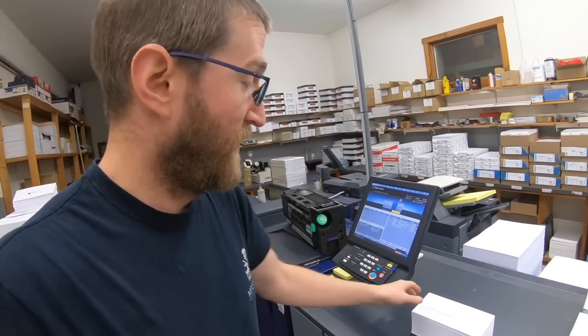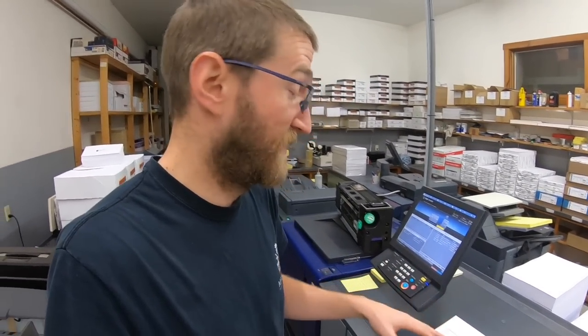Got all the number nines done and started the number tens. I have about either four or five different designs for the number tens, so that actually makes it a little more economical to run on a digital press. One thing to remember, you do need to get specifically digital window envelopes if you're going to be doing toner on the envelopes. That's because the little clear windows on the regular windows don't take the heat, so they have to use magic plastic to work that out. So you have to make sure for windows you get digital number 10s.